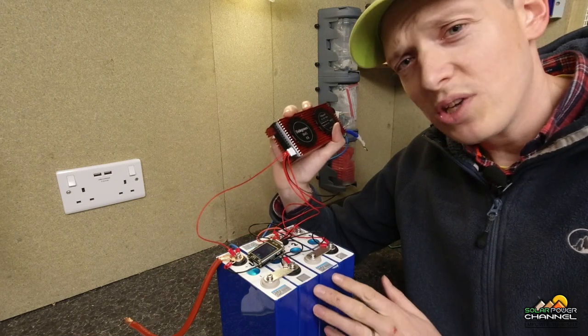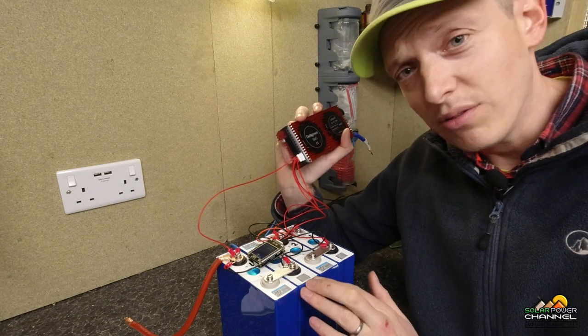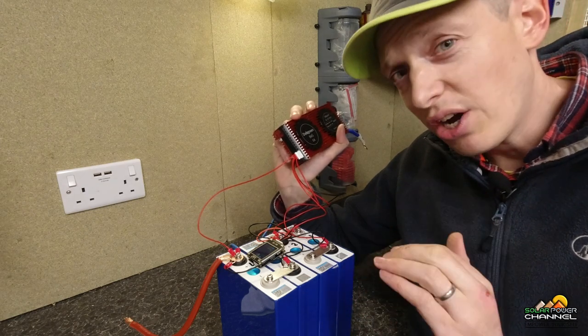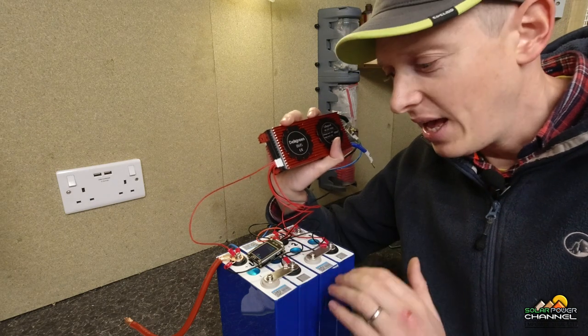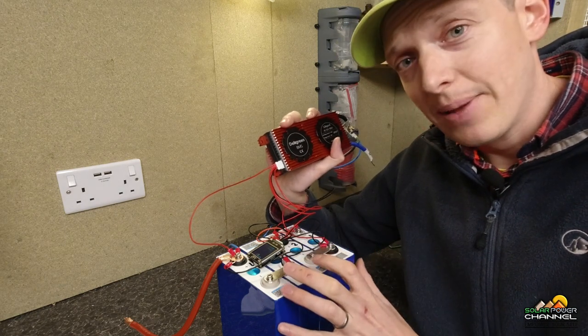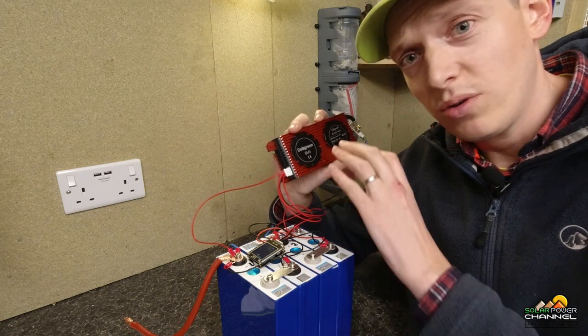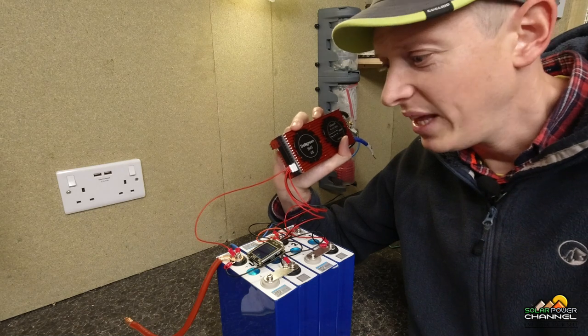And also, if it's not able to do that, and this battery then shoots over the 3.6 volts while these other batteries are still just shy below, the BMS will then cut the power that's charging these batteries until there's adequate power discharging on the outlet.